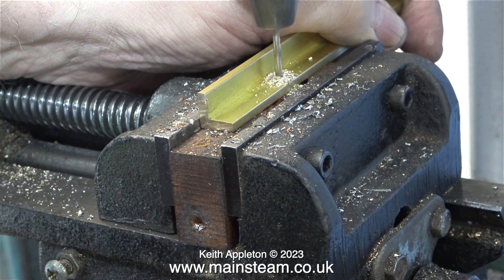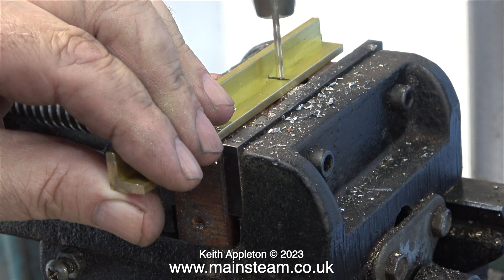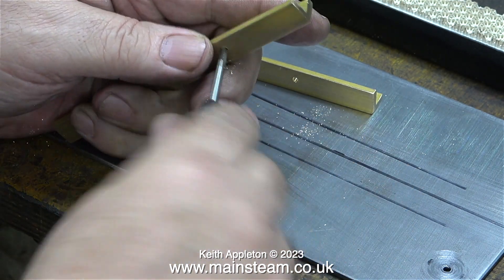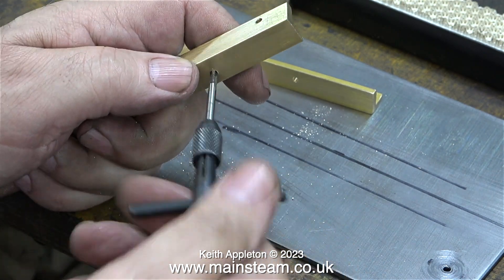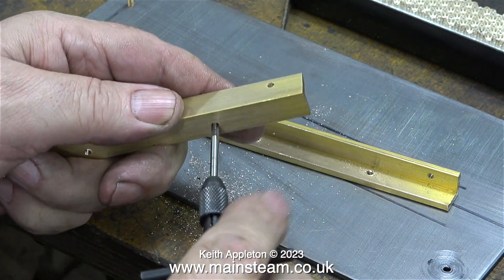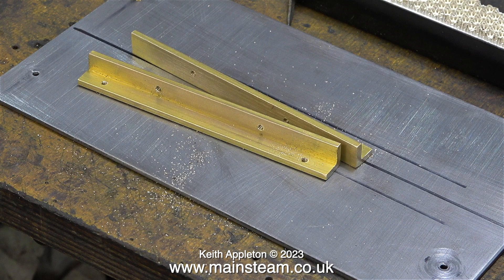This is a bit of an experiment and I will show it in detail in the next video. Currently I'm drilling the holes at tapping size for 5BA — the tapping size drill is supposed to be 2.65mm but I don't have one that size, so I'm using 2.6mm diameter. For this job I'm using a small 5BA taper tap, which seems to thread the holes in the brass perfectly. I'm not using any lubricant because brass generally doesn't need it. If I were to use lubricant, machine oil is quite good — I would normally use 3-in-1, or paraffin, which is also used for aluminium. Some greasy tapping compounds can be counterproductive on certain metals because the thick consistency holds chips in place, which could damage the thread as the tap goes through and is then withdrawn.